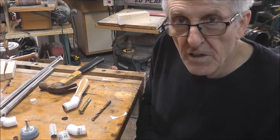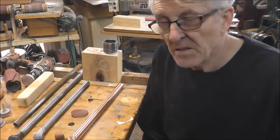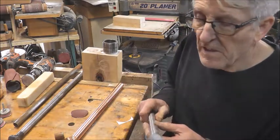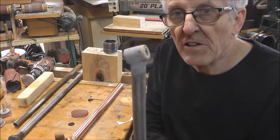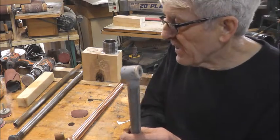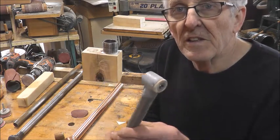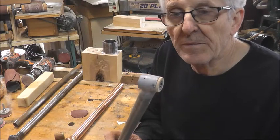We'll talk about the metal ones in the next segment. I wanted something that goes inside a hollow turning, so I came up with the idea of putting them on pieces of tubing. You could use conduit or different types of tubing — they have to be welded on to another piece. These are five-eighths, this handle was a three-quarter inch, two different sizes. You could use the same size so you only had to buy one piece of tubing, but I just had this leftover — it was 4130 from a friend who was building an airplane.